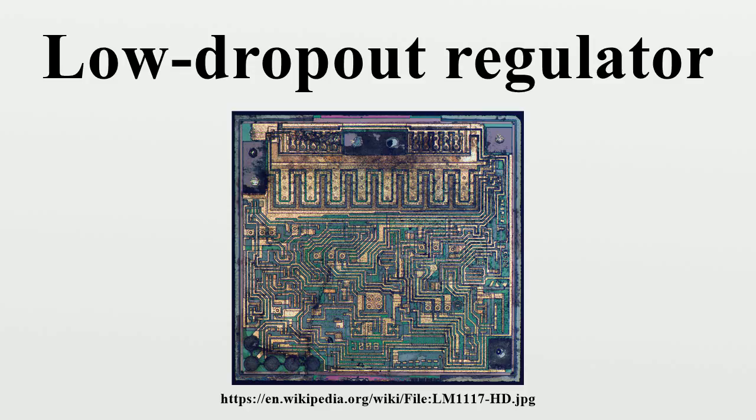Many applications don't require an LDO to be in full operation all of the time. In this idle state, the LDO still draws a small amount of quiescent current in order to keep the internal circuitry ready in case a load is presented. When no current is being supplied to the load, it can be found as follows.